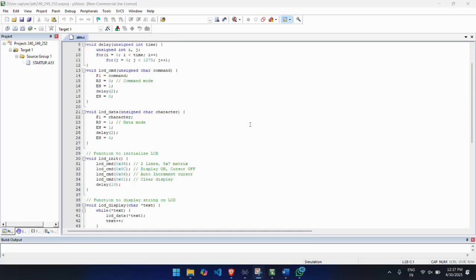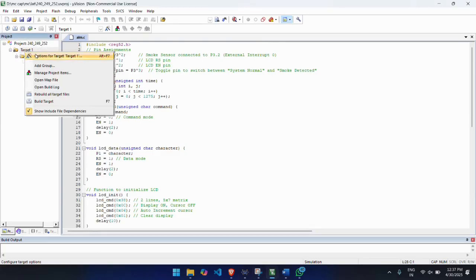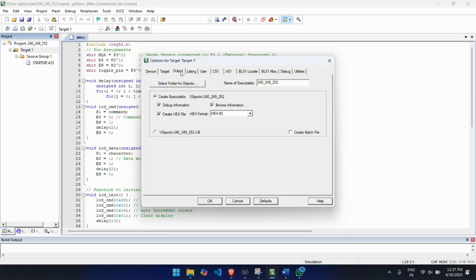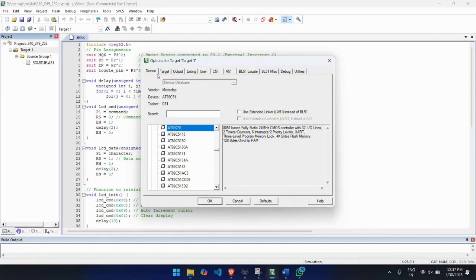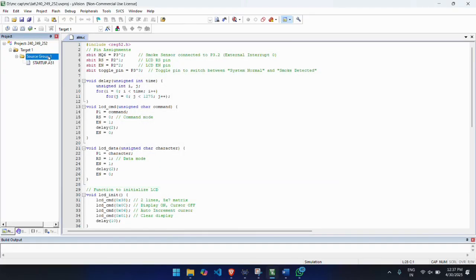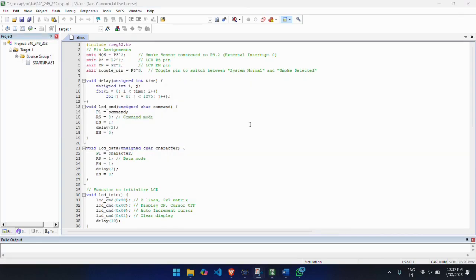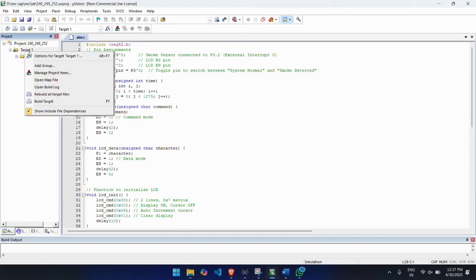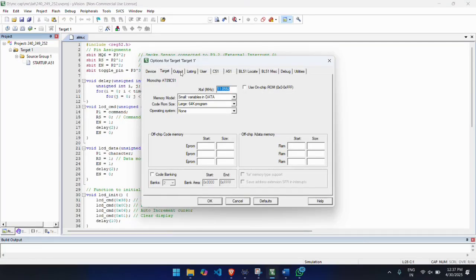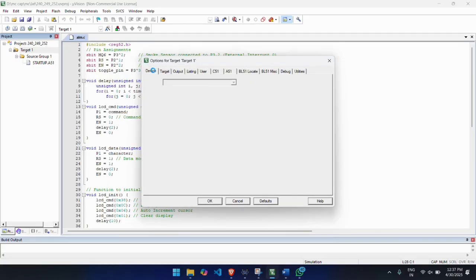I2C LCD display. We are using a 16 by 2 character LCD display with an I2C module for displaying messages. The I2C interface allows communication using just two wires, SDA and SCL, which reduces the number of IO pins needed on the microcontroller. This display shows the status like gas detected or environment safe in real time, helping the users understand the current condition at a glance. Its backlight and clear text make it suitable for both indoor and outdoor environment.